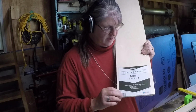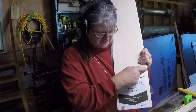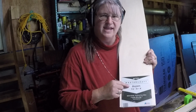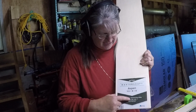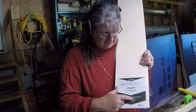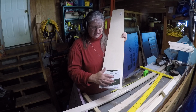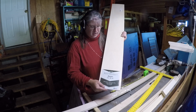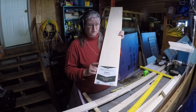Something that should be noted when you purchase wood: the size 1/2 by 8 inches by 4 feet long is not the actual size of the wood. If you look in the description, you'll see that it says actual size. Instead of 1/2, it's 7/16. Instead of 8, it's 7 1/4. And instead of 4, it's 4 inch. Well, it is 4 feet. The length is what it says it is, but the other two are usually cut short on the size. So keep that in mind when you're making your projects with finished wood. Let's get started with this project.